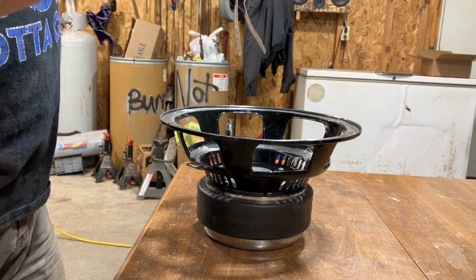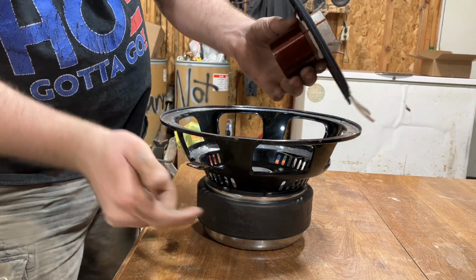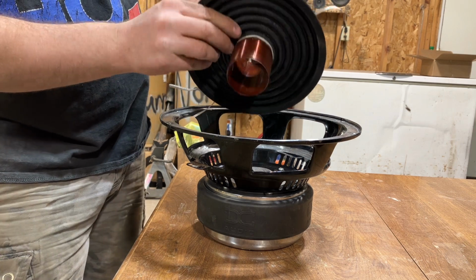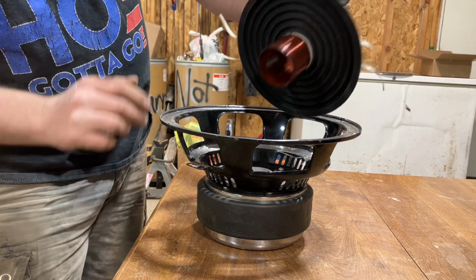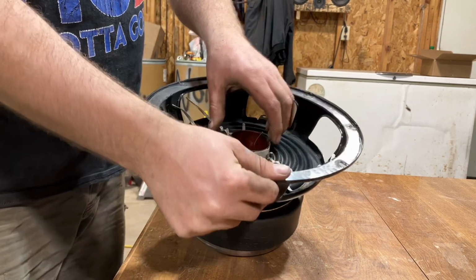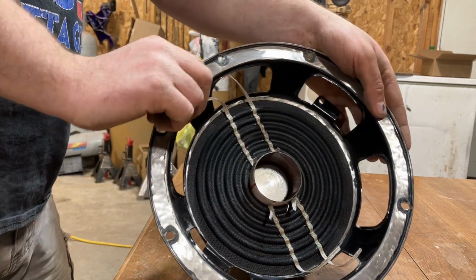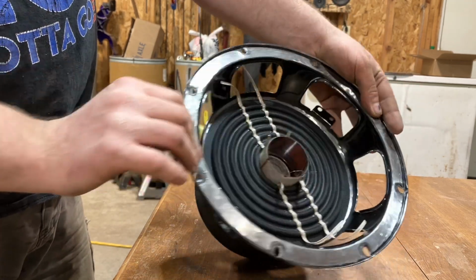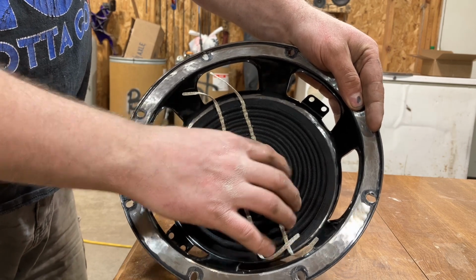And we will figure out the halfway point of the gap. That's another reason too, I have kind of a peephole. I can see where this gap is, so I can adjust the coil up and down on the subwoofer suspension. So a 7.4-inch spider fits in the stamp steel basket. I don't know what stamp steel basket this is. I'm sure other companies have used this in the past. So I do have a little bit of wiggle room.